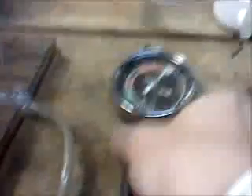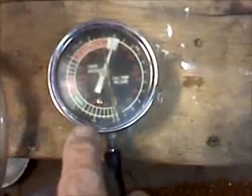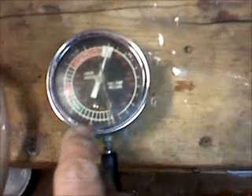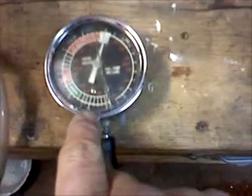From the T-fitting, it comes around to my vacuum gauge, and I'll be showing you the actual vacuum readings shortly. That mark right there is 25 inches of mercury, and the next division over is 26 inches of mercury. When the cell is producing under vacuum, you'll see the needle anywhere between 25 and 26 inches of mercury.